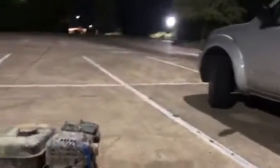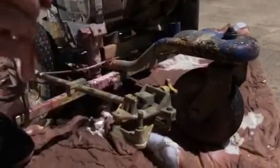Now we're going to mount the gun — this is a real critical part. I'm going to get this out of the way so we don't stumble on it. Notice how my gun is facing upwards. Make sure we've got enough slack in the hose so we're not binding, but not too much that it's going to get caught up under the wheel. Back the wing nut up a little bit.